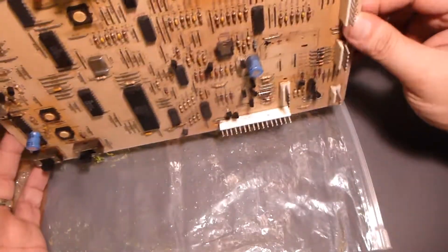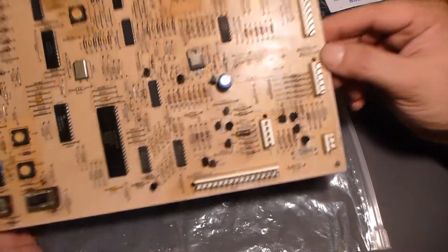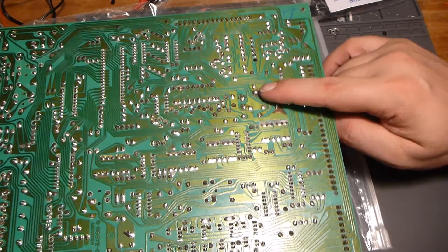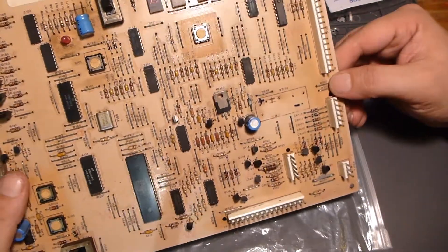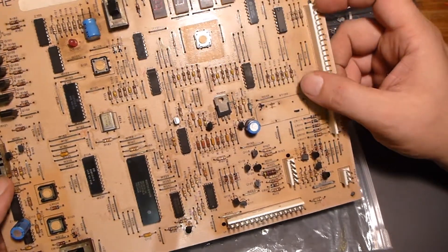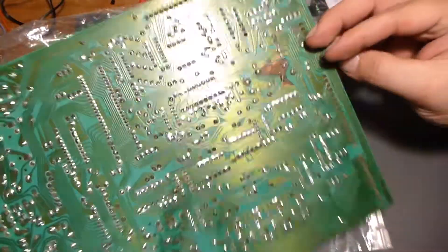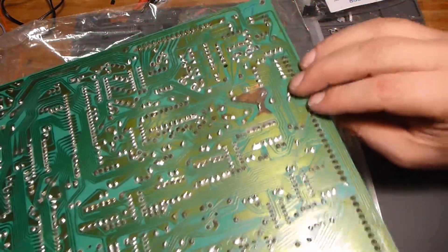So this is kind of a favor, and I'm going to do it the old way, which I am not a fan of. We're going to be cleaning this area up, replace some conformal coating, check these pads out, remove all three of the electrolytic capacitors, clean the board up, and check out some of these diodes. I can at least do that and increase the statistical probability that it will work. But it's by no means a good repair, so I'll give you a little warning.